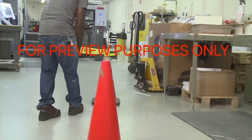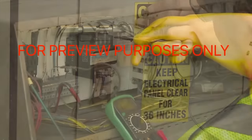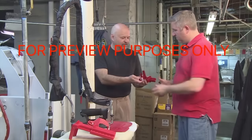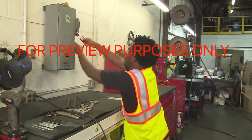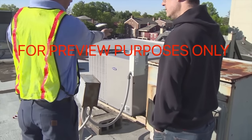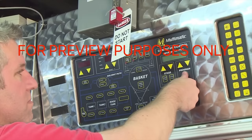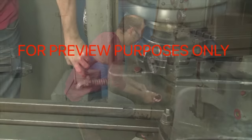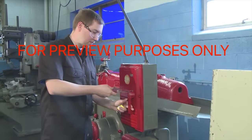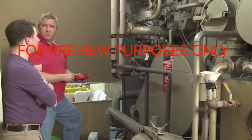You may also need to physically isolate locked-out hydraulic and pneumatic machinery to make sure moving parts aren't jostled free by passing forklifts or other equipment. Barricades or other devices can be used to limit this type of traffic, and in some cases you may even need to arrange for the shutdown of nearby machinery. Lockout/tagout is essential when working on most equipment and machinery. Remember these basics: identify all energy sources, each worker must attach their own lockout/tagout device, equipment must be tested after locks and tags are in place, and the person removing the last lockout device must confirm work is completed and it is safe to operate. Common sense, communication, and a good knowledge of lockout/tagout procedures are the keys to everyone's safety when working on powered equipment.